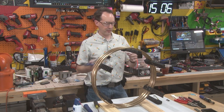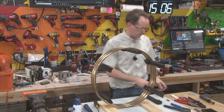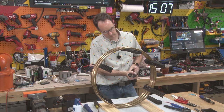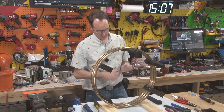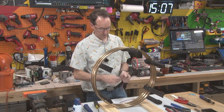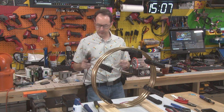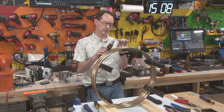These will be pretty quick and easy. I'm only going to do this end to start because I got to lace them through and I want to have the other end nice and neat and pretty. Now that we've got those crimped, we'll tug test each one, and then we're going to bake them at 350 for a few seconds until shrinkage occurs. These connectors will live a lot longer than the old ones did.